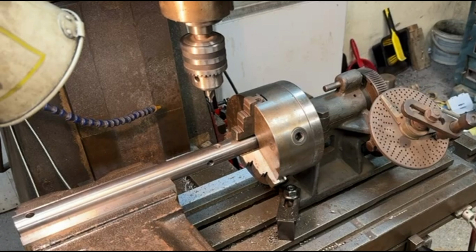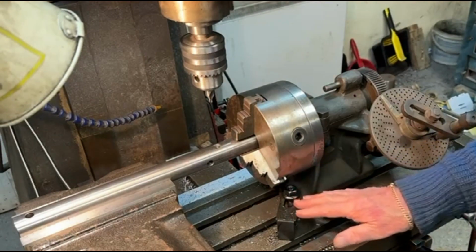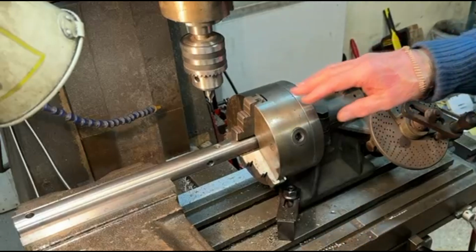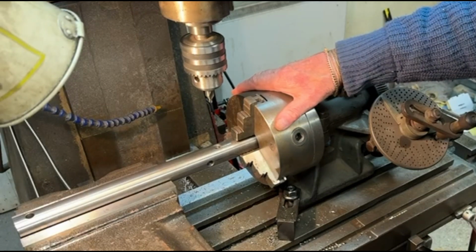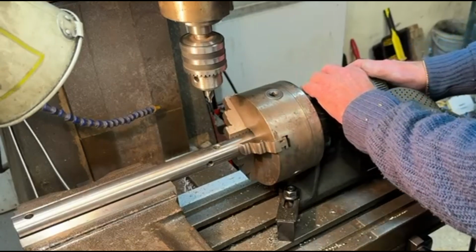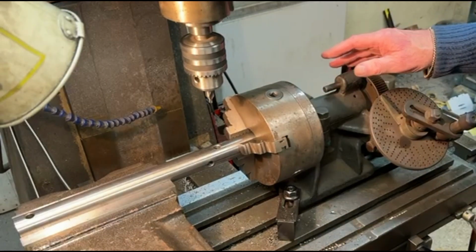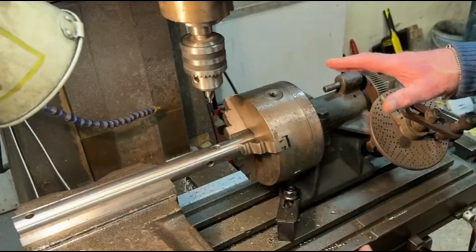As you can see, what I've done, I've set up the dividing head. I've literally clamped it to the table rather than using the T-slots, so that this whole shaft lines up with the vise itself. So all I've got to do to rotate the head is release the vise, release the dividing head, and then I can turn through 90 degrees and drill at whatever angle I want. I could just turn it, lock up here, everything's solid, nice and firm.